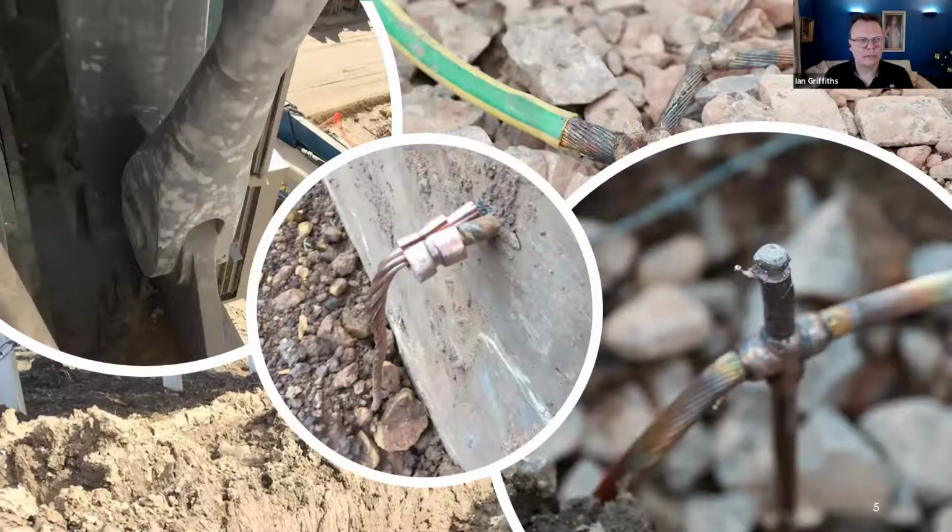So what does an earthing electrode look like? What does an earthing arrangement look like? There are all sorts of conductive objects and structures. Here, for example, we've got steel structure, significant steel structure above ground. This might be to take away the current from a lightning strike, but equally it could be a pile under the ground that can be utilized. Here we've got some foundation electrode where the rebar is connected to another earth grid, a buried earth grid mat outside. We've got horizontal electrodes making up a grid, and we've got electrodes that are coated in PVC, insulated. There's an interesting one about that, and I'll come on to that in a minute.